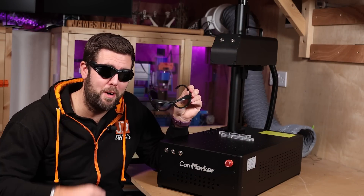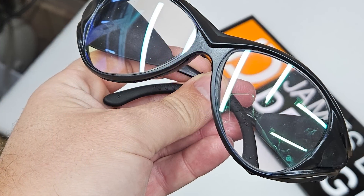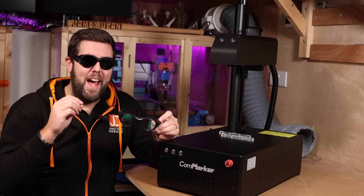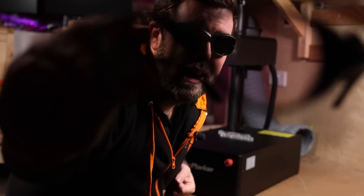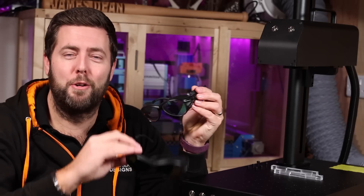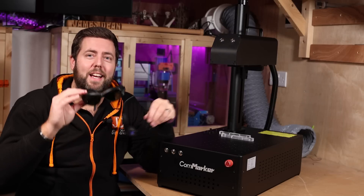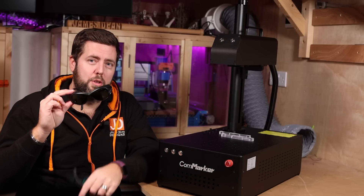Second: make sure you look cool whilst you are lasering — obviously I'm joking. It is laser safety in regards to the goggles. You do get a set that comes with the laser — clear lenses with a coating that protects you from the infrared laser. However, when you are lasering metal it generates a bright white light, a bit like welding, and this can sometimes damage your eyes. The included goggles really don't stop any light coming through. In comparison, the ones I'm wearing are rated at an optical density of six and are much darker. They also have official ratings marked on the lens. Consider paying for upgraded glasses — maybe $40–$50 off Amazon — and make sure you get ones with official ratings on them.